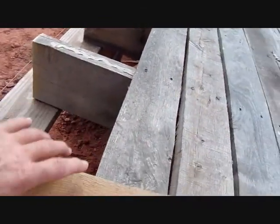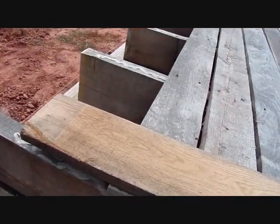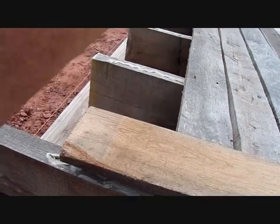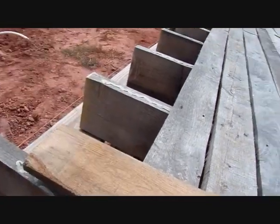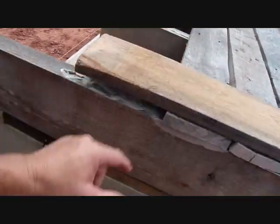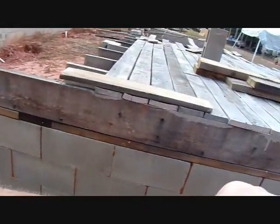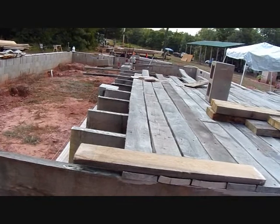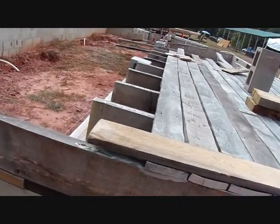So what'll happen, I'll drill a hole through the log all the way down through the floor, and come up to that first log and drill out a spacer hole so I can put a nut down on top of that. I'll bolt the all thread down into that other nut I just put on there, so that first log will pull everything tight down all the way to the rebar, so it'll be solid. If I put 3 or 4 on this side and 4 or 6 on that side, talk about solid that way, huh? So I'm thinking about doing that, probably will. And then that's tight.